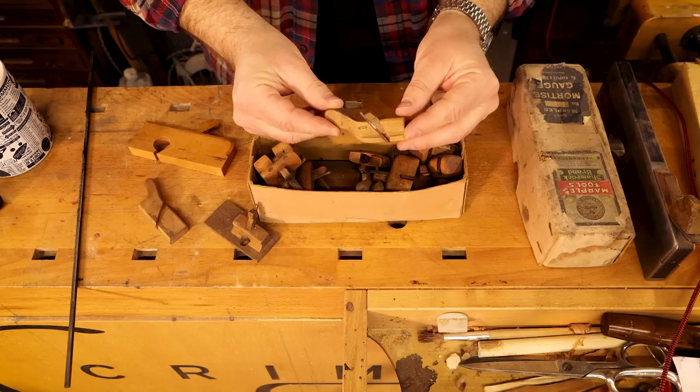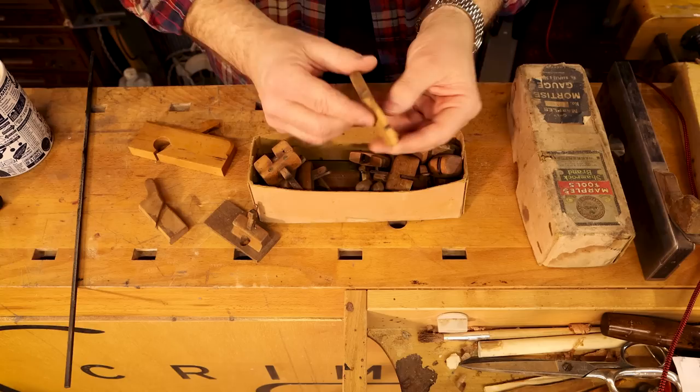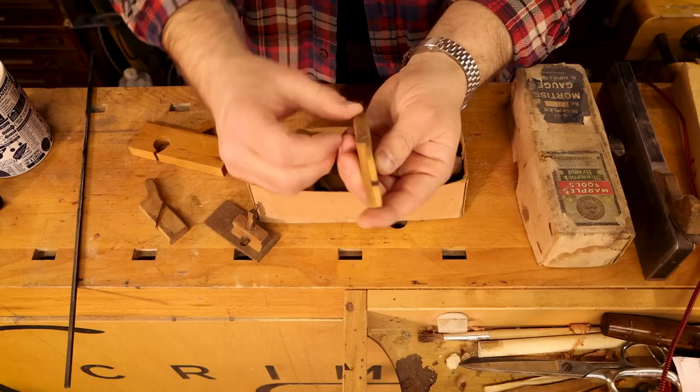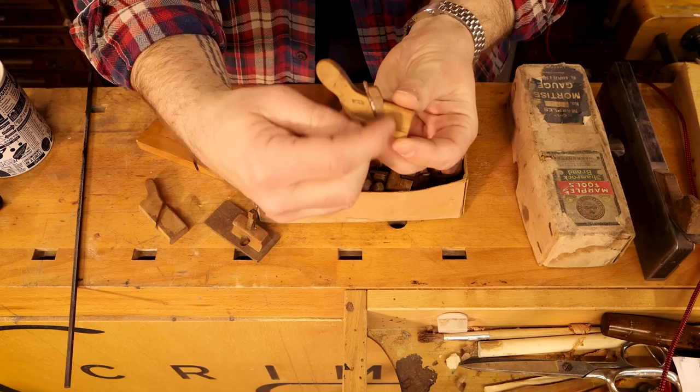This one I seriously considered customizing for the purpose. It's got curved sides — it's almost closer to a coachbuilder's plane actually. I can see that serves a purpose — that hole — same thing here. You've got an area there, and that's where your shavings need to escape. Of course I could just use one of the small router planes, but that means I don't get to make a new rabbit rebate dado plane kind of thing. And that would be sad — just actually terrible.